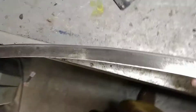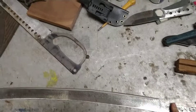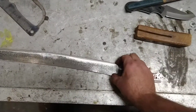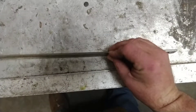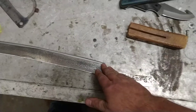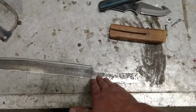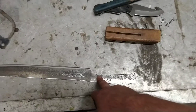It's got a lot of flex to it. The original handle ended about here, so one thing I did was lengthen the handle. It's still dull right here — the blade doesn't start until even farther up — so I could grind into it a little bit to make it a solid tang. I will try drilling another hole to get one more pin in there.